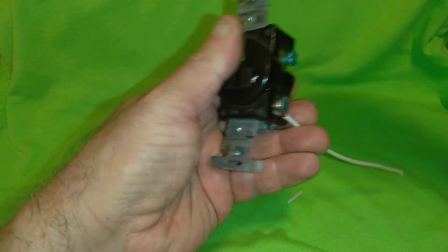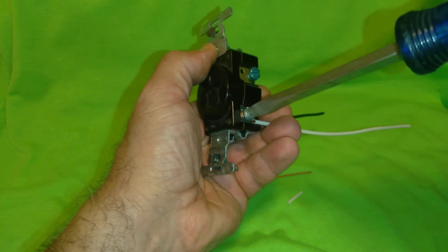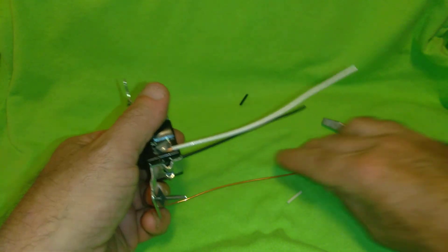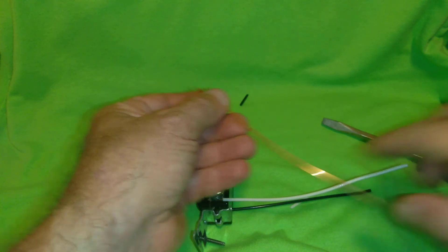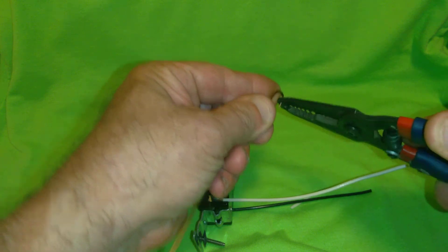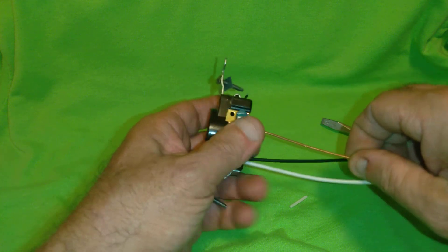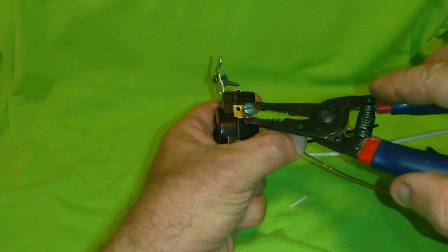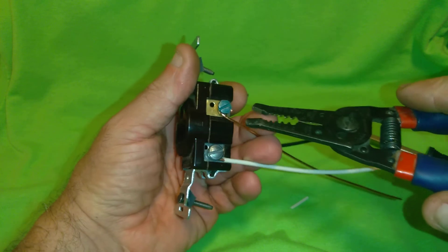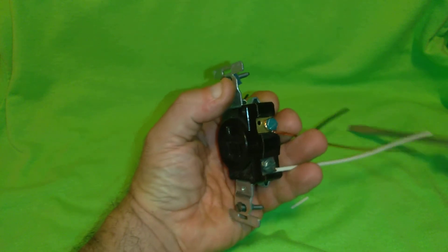You can use your two fingers to pull back on the wire and tighten the loop, then snug it down. For your ground wire, if it's green, strip the insulation and do the same steps. Make the loop in the direction that the screw turns — I'm making it a little bigger so you can see the direction. Come over with your pliers, close your loop, and hold it back like this.